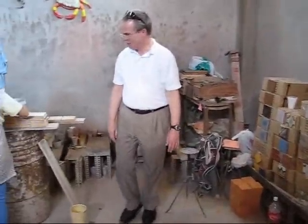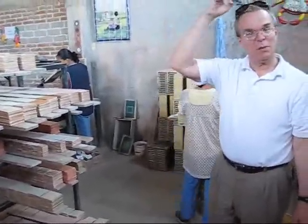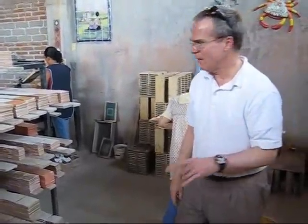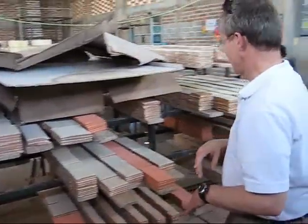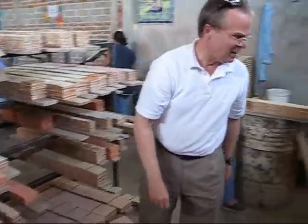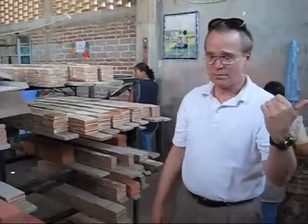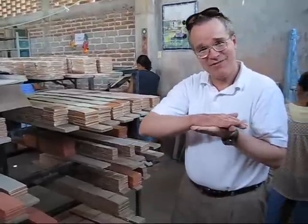When we produce tiles, the tiles are bought. We buy the bases from a different fabrica that makes them. One difference about our tiles is that the tiles themselves, they're all painted, are made in a 50-ton hydraulic press, which adds density, which improves the quality of the tile. It adds consistency of size and shape, and it adds consistency of flatness.